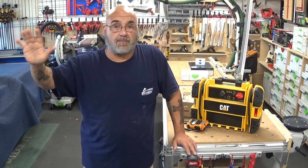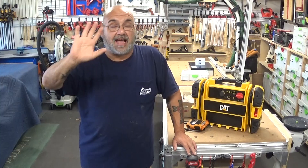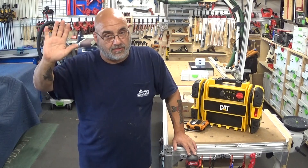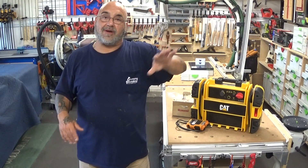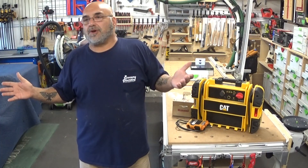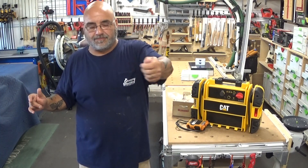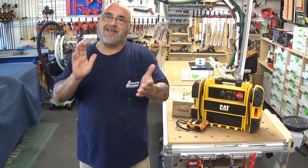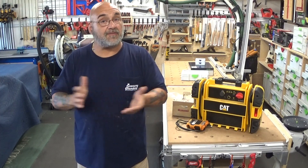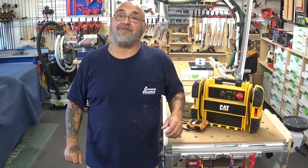Just remember to let your customers know ahead of time. My daughter made probably a hundred-plus better calls on the Friday before the storm was going to hit, telling people to unplug or shut off the tankless heater before power goes down. Once you lose power, tell your customer or do it yourself — you don't have to do it the moment a storm is threatening. If it looks like an outage of only an hour or two it should be fine, but once you lose power, unplug it, and once power comes back plug it in. It'll save a lot of heartache. I hope this was informative — if you like the video please like and subscribe, and I'll see you on the next video. Have a safe and productive week!